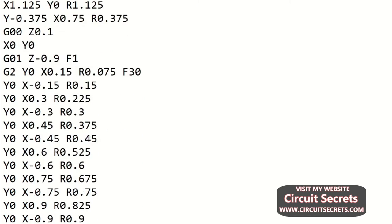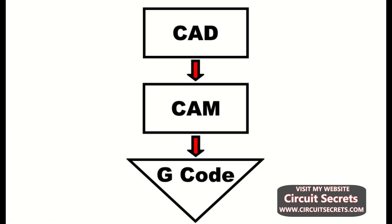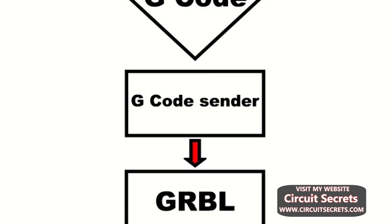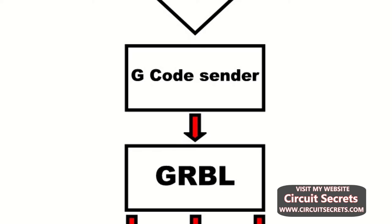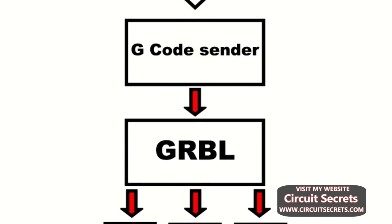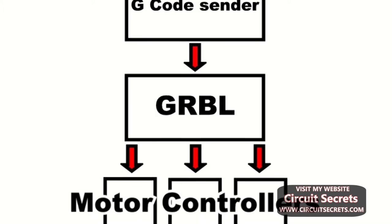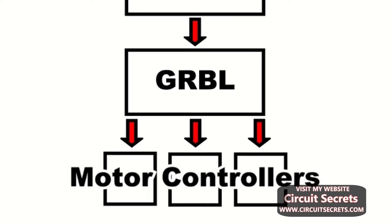The specific syntax of G-code commands will depend on the type of machine being used as well as the specific software generating the code. G-code can be thought of as the machine code output by CAD/CAM software. CAD software allows users to draw or design elements in 2D or 3D. CAM software checks the design for errors and generates machine language such as G-code. The G-code then passes through a sequential G-code sender, either built into the machine or running on a separate computer, which communicates with the main control board — in most home-built machines, an Arduino running Grbl.